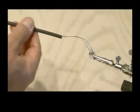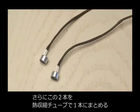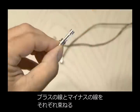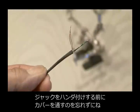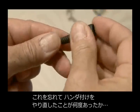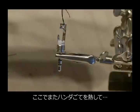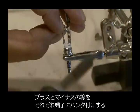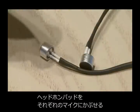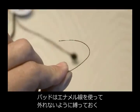Then to make the wire a little sturdier, we're going to use another piece of heat shrink tubing to hold those in place. Our two leads are complete, and now it's time for another piece of shrink tubing to join the left and right into a single cable. Now we'll unscrew the housing for our stereo jack and join the positive and negative wires together. Don't forget to put the housing over this before you make your solder connections — I don't know how many times I've done the opposite and had to unsolder what I just did to get the housing on. So take your hot tool and heat that metal alloy again until it melts and join the wires for the positive and negative to the connections on the stereo jack. Now it's time to finish up the mics — we'll take our earbud replacement cushions and put those over each microphone. I also used a piece of magnet wire and wrapped it tightly to hold the foam in place.